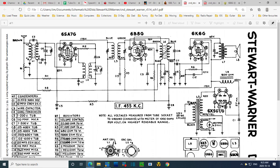Okay. Now, when this is in this top position and the radio is silent, at that point the ground is further removed from this line because it has this resistance in there. Unless this is like a 10 ohm resistor or something crazy like that. I'm guessing this is a few thousand anyway. So when you want the radio to play loudly and you've slid this down to here, you now have applied a ground to the bottom of this coil past this small resistor.